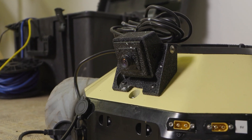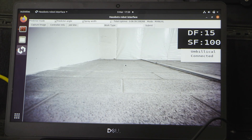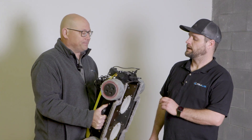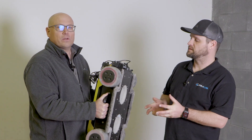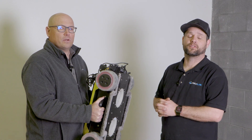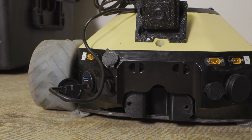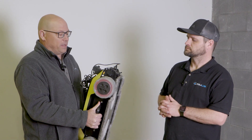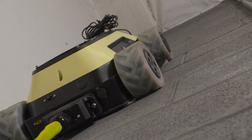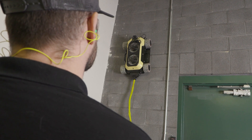Like Lance mentioned, up at the top here we have the ports. There's a simple camera on there right now, but what we're evaluating is different use cases. Painting is definitely one of them, inspecting tanks, x-raying, doing whatever needs to be done on a very tall structure that's difficult for a human to get to. One of the things in UT testing, or anytime you need to have contact with the object — which is sometimes difficult with drones — this can carry a pretty heavy payload. You're able to mount that on the front while it's holding onto the wall, and then control it via remote control and do the testing that you might need to.